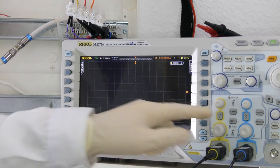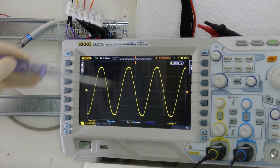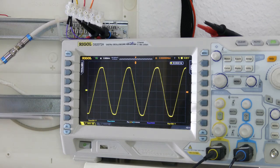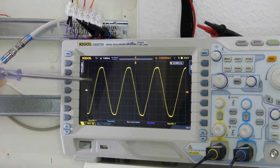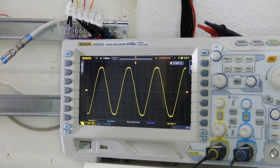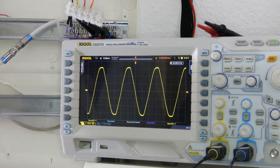Now let's enable channel one. Here you can see the AC waveform of phase one — we have 100 volts per division. You can see that the volt max is 324 volts, and the minimum is also around 320 volts as shown here. But still, this means this is 230 volt AC. This is because of how AC voltages are calculated — you don't sum up all the values over time, because that would be zero volts since you have as many positive values as negative values. What you do is use volt RMS: root mean square. All the values you square, add, and root. And that means the root mean square value. And this is 231 volts as you can see here. There's also a fast way to calculate it: just take the voltage max of 320 volts and divide by the square root of 2. This works with sinusoidal waves though, not with all other waves.